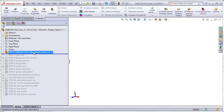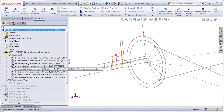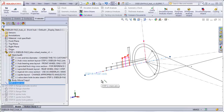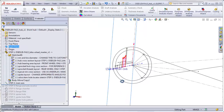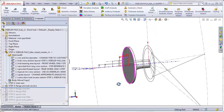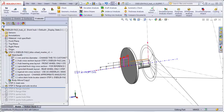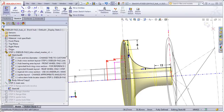At this point, I'm going to switch back to my completed hub and roll back the feature tree to step number two. Step number one was the insertion of the master. Here we see our sketches, and four of them are hidden because they are not needed for hub creation. Moving to step two, this is simply an axis passing through the top and the right plane. The next step is creating the actual flange itself, which is a revolve feature. This flange also includes the actual shell.